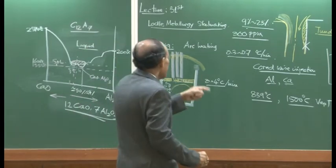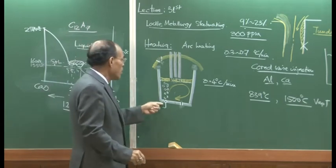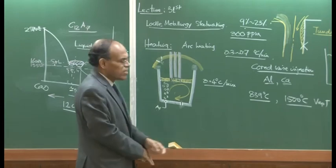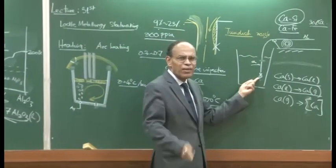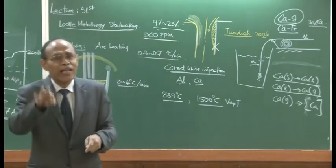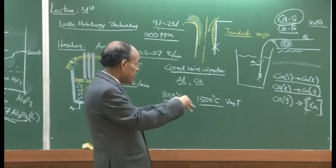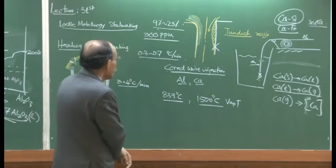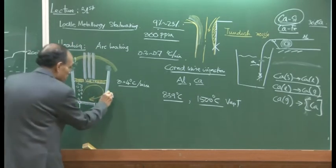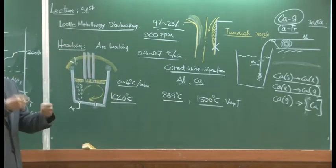Now, having said that, we have done deoxidation, we have finished heating. This injection, etc., will not cause a significant drop in temperature, as this is a trim composition adjustment where a small amount of solid material is used. But there is a step coming ahead of us where the temperature drop could be enormous, that we will discuss next. But so, we have increased the temperature, maybe 1620 degrees centigrade. That is our LRF out temperature.